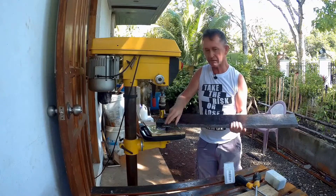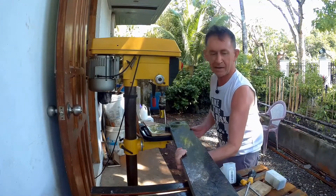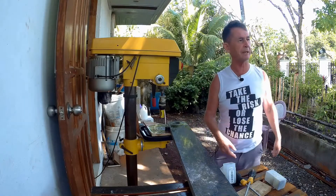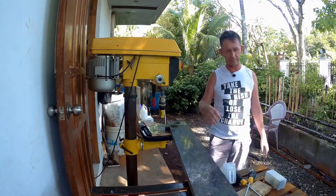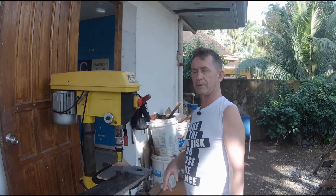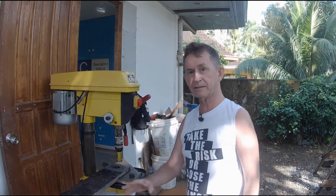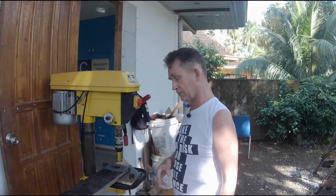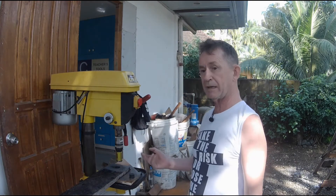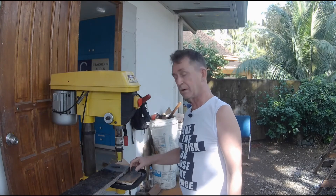So that's how you drill granite on a budget. I used a new bit for this video, but I bought three bits at the one time. I used one bit for doing about 10 holes and it's still fine. So for making your hole for your faucet, you can get these in different sizes. To do solid granite like this, you need to use water and you need to have a drill press.